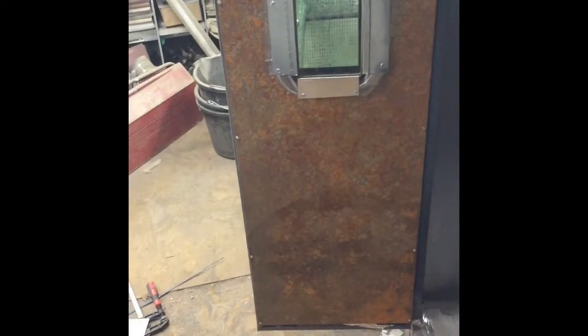The panel is screwed back on with a number of self-tapping screws. When I do the final fit I'll be filling this with insulation, sealing up the top with some tape, as well as sealing around this back edge here to make sure there's no way the heat can escape. I'll be sealing all around the glass with heat-resistant sealant and tape as well. Once the glass is clean — which I still need to do on this trial fit — hopefully I'll get good visibility looking into the cabinet.